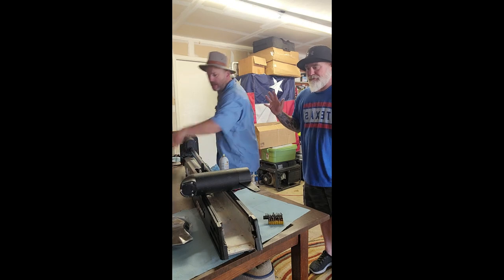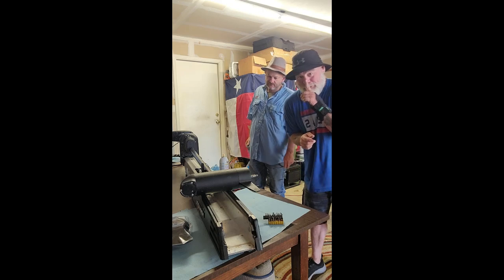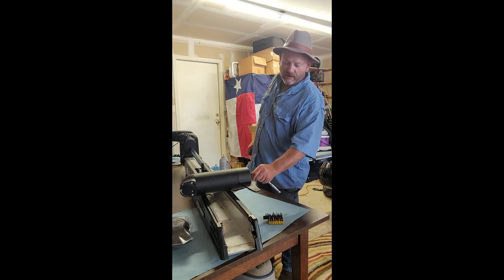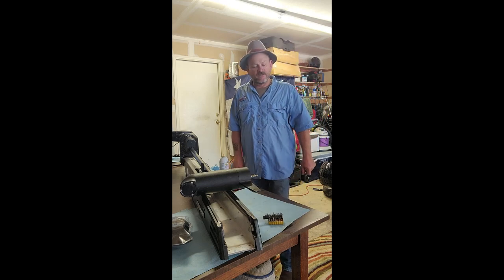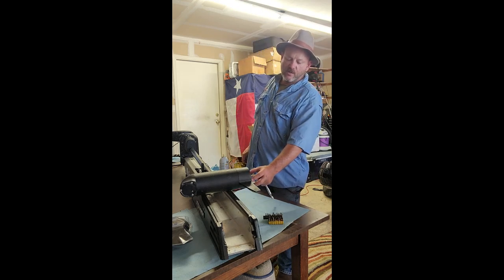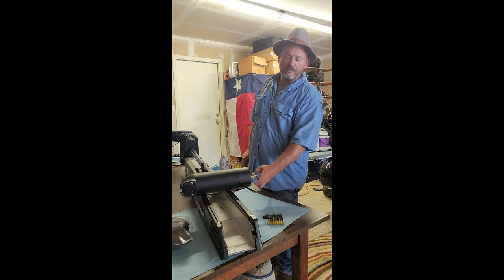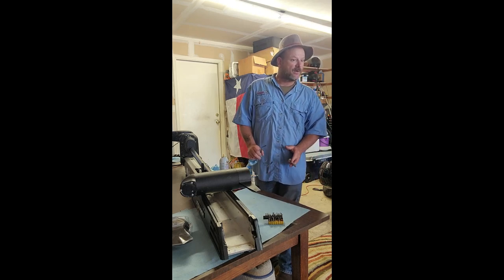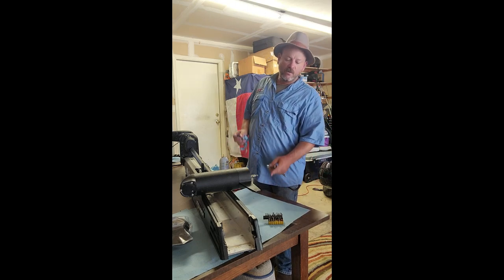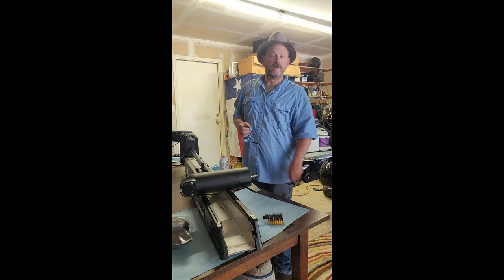I just want to let everybody know why we're doing this - we're not just taking this apart for no good reason. It's actually under warranty. We've already taken the prop off. If you don't know how to get the prop off, this video may be a little bit advanced. We have two big bolts that go through this front to back. Typically when we drained it in the past, we just loosened those bolts because we didn't want to take it all the way apart in the middle of the lake on a good fishing day. What I'm anticipating seeing when we open this up is some black, nasty looking water.